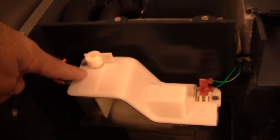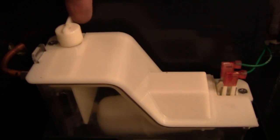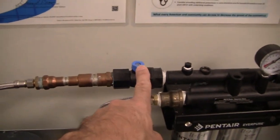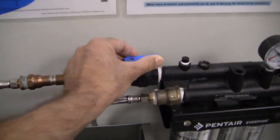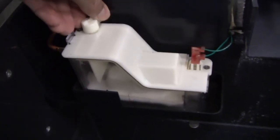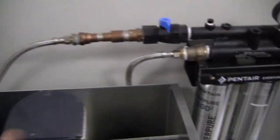Step six is to shut the water supply off at the reservoir by turning the knob counterclockwise. Turning this counterclockwise takes the float and locks it in an up position, shutting off the water. I can also shut the water off manually here. With the water energized, you can see it filling right there — I'll go ahead and shut off my manual valve as well.